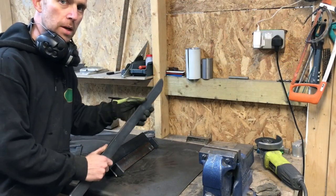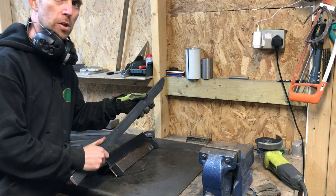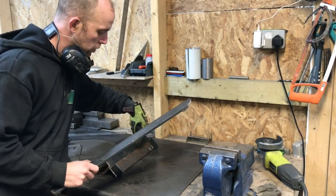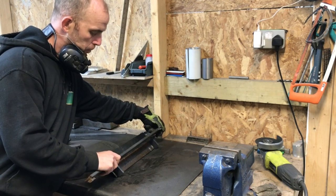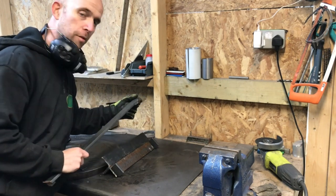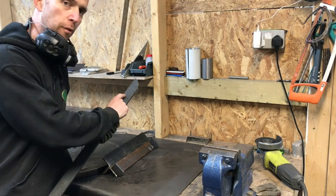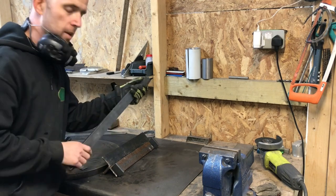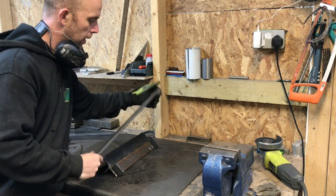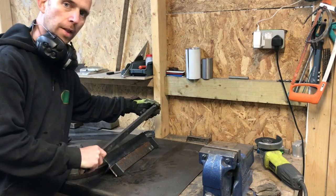The next bit I'm going to do is cut this to size. This is going to be your main face which is going to do the bending. Once your sheet is clamped there, you are literally going to push down and that's going to fold your metal — so a very important piece. This is 40mm wide, 10mm thick, so all I'll have to do is attach a handle to the end of it. I'll mark that in between there and cut that now.